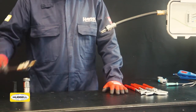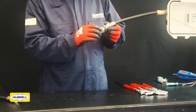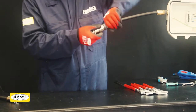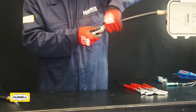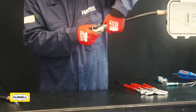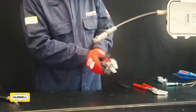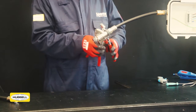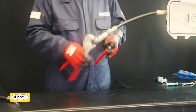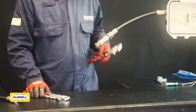To hook up the 501 RCG coupler, take the first terminated 501 RCG body and slide the coupler insert, engaging the keyways and pins into sockets. Slide the coupler housing over the pin insert and hand tighten. Grip the coupler housing with a wrench and use a second wrench to apply a further quarter turn to the middle nut.